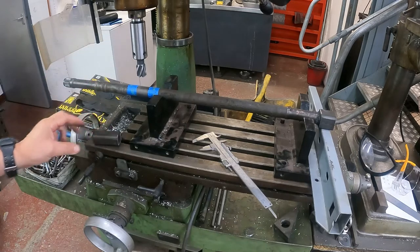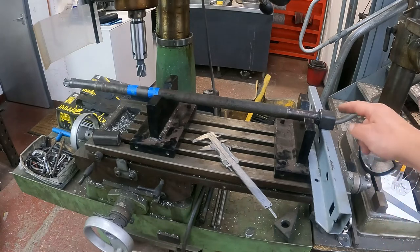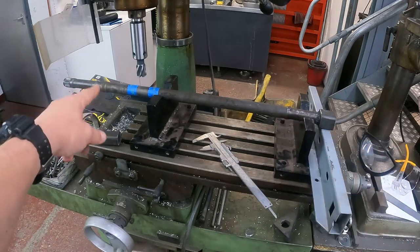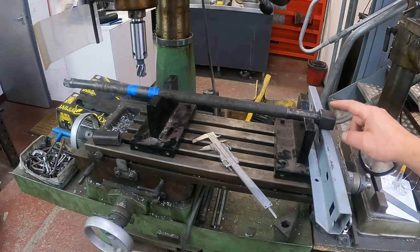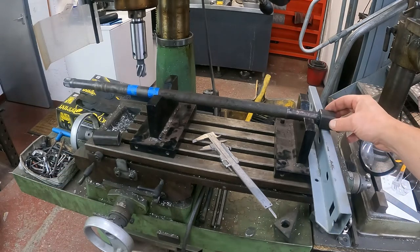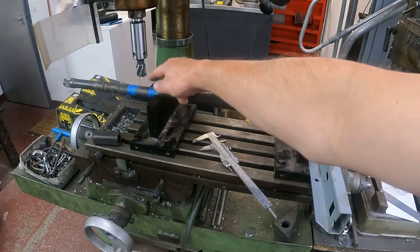Sounds simple enough. What I've done on this end here, and this is the redundant end, I won't be needing any of this after. It's just the front part I'm after. This is 30mm tube, 3mm wall, whilst that is 25mm. I've fitted that on there, and once I've milled that flat,